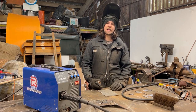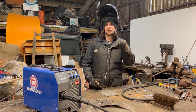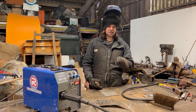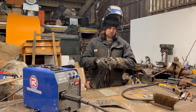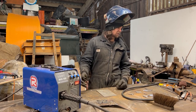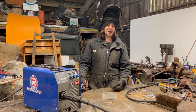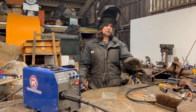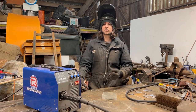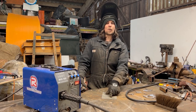As a beginner, starting out, I would learn just by doing some lines of weld. Think of it a bit like a pool of metal, and you're kind of drawing with the metal. I'd use a bit of thicker stuff to begin with, and that'll be a good way to get practice in setting up your MIG welder. Before I weld a piece anyway, I sometimes do some tester welds on scrap bits of metal, just to make sure it's working alright, and you can usually tell by the weld after it.